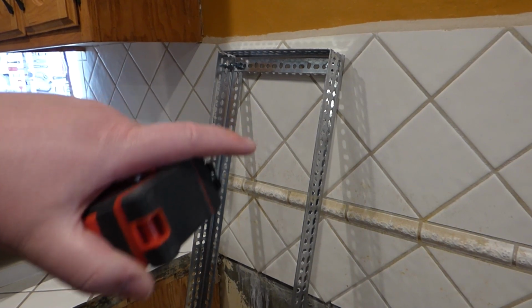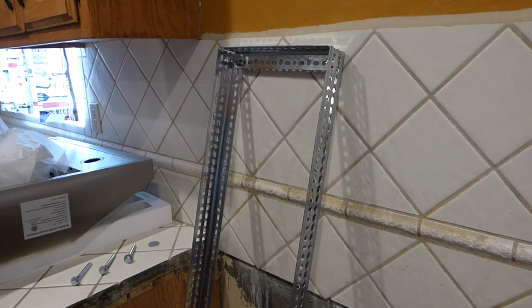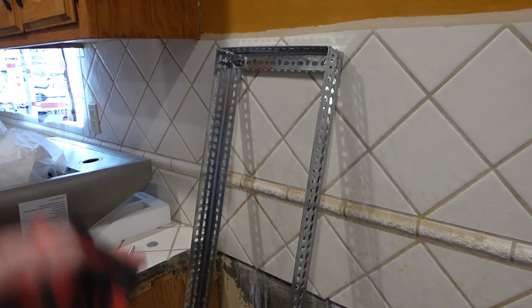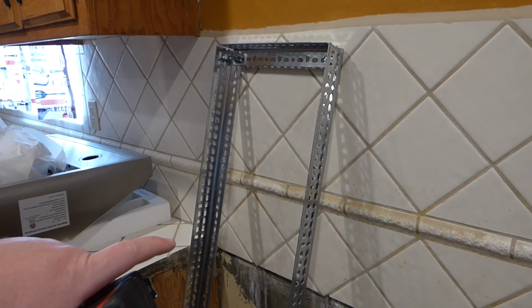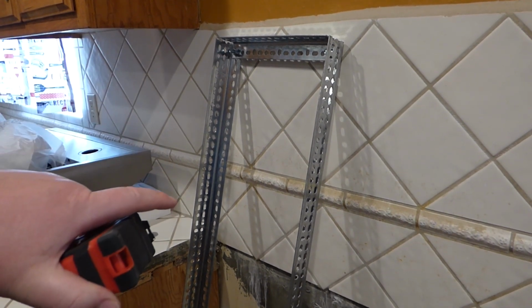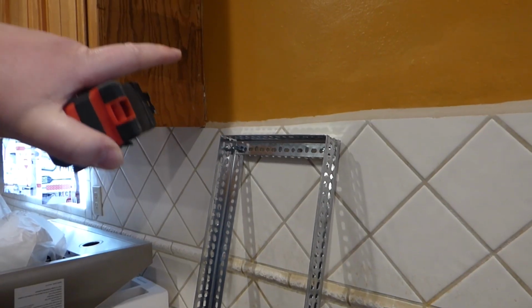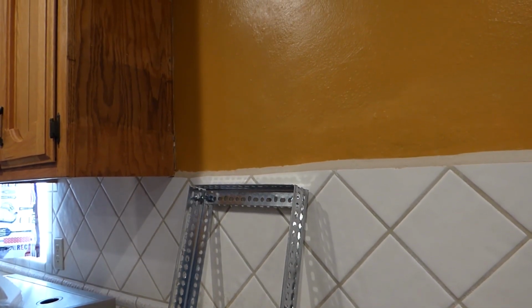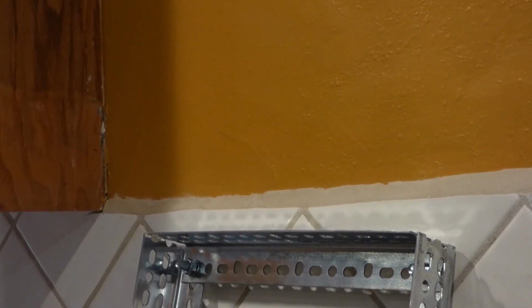If you have your range hoods a little bit higher, you usually might have a little bit less efficiency of getting the smells out, whatever, but these seem to have pretty good CFM flow, so I don't think that's going to be a problem. If you have it lower though, I think they said it could mess with the gas burners on top. Not too sure. But measurements, I'm going to do 31 inches. Actually, what I'm going to do is 32 from the countertop here and mark it up on the cupboard there in the wall. And that 32 will give me my 31 with a 1-inch buffer from the bottom part here.